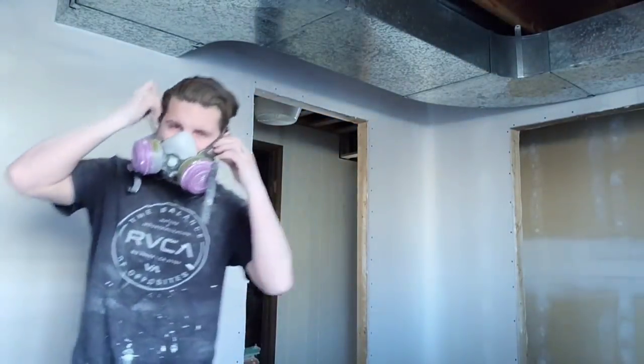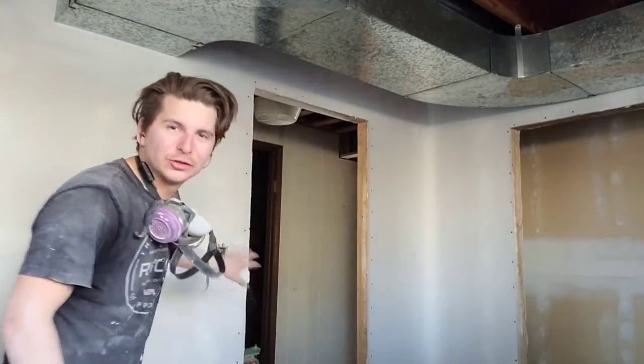Okay, now basically just do that in your whole project and you will be basically done. I hope how I sanded it out and showed you guys kind of demonstrates properly how to sand. That's basically more or less how it works, from rough to smooth. From there you can move on to prime if you have no touch-ups to do. In our case, we have two touch-ups.